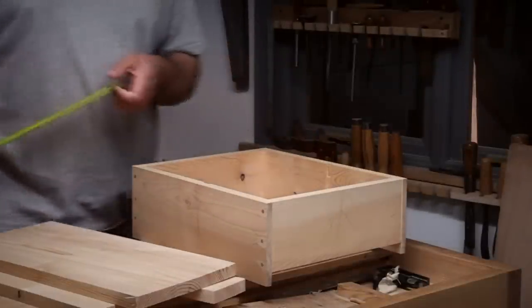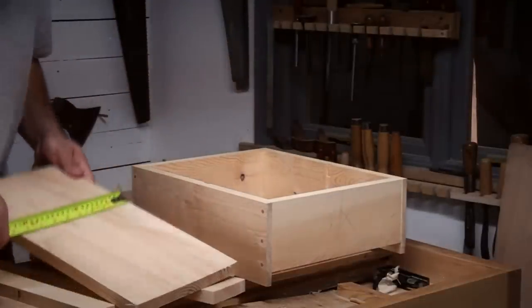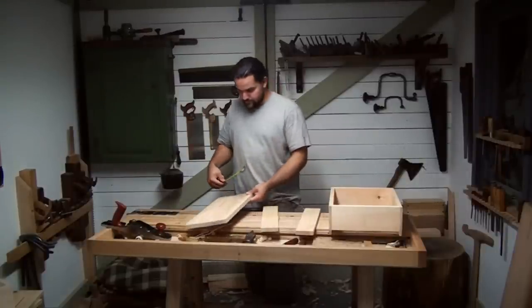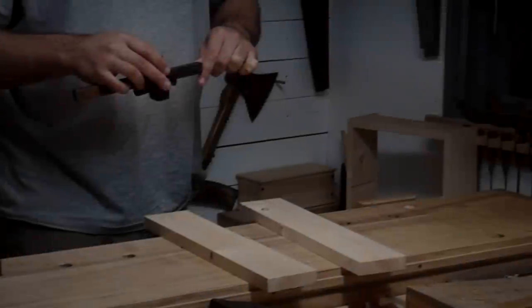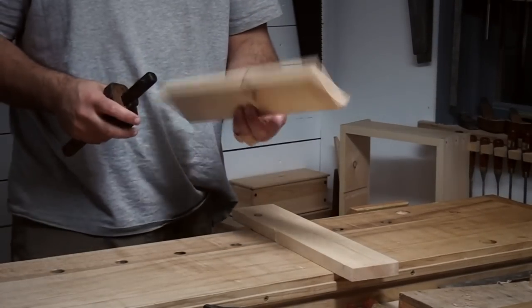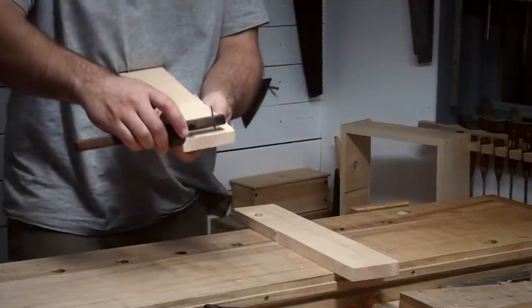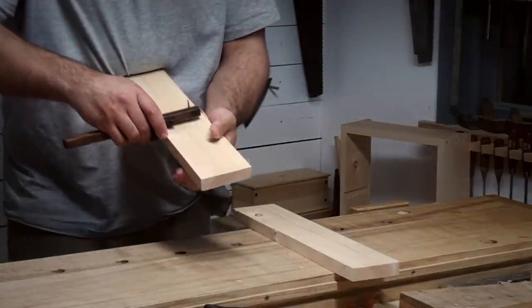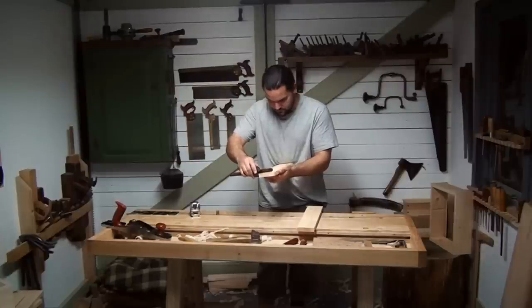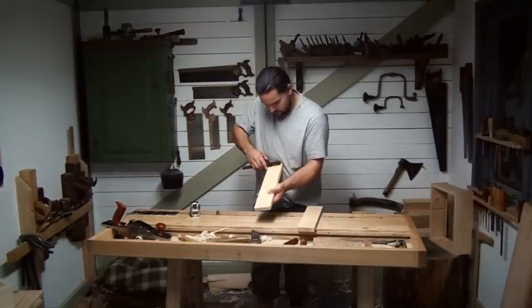Now I need to prepare the two pieces for the face frame. The plan states a width for these, but having checked out the widest board I have available for the door, I decided to increase them. My door's going to end up a quarter inch too narrow, so by adding one eighth to each frame piece I'll still be able to get it from one board. I'll make my face frame using the offcuts I saved when I cut the carcass sides.